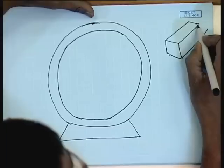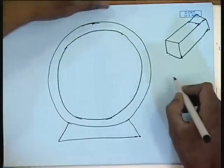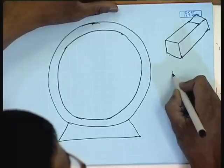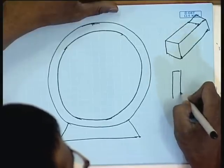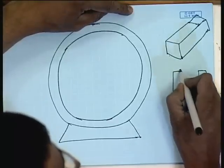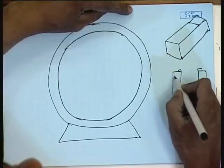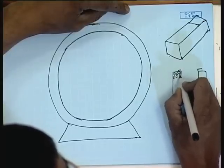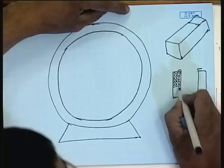This is the pole structure which carries the field winding. Field winding is made on a separate cylinder and depending on what type of winding it is — that is either shunt or series — the number of turns and the current carrying capacity of the turns are determined. I am showing a winding for shunt connection or separate excitation, which are normally made up of thin wires with a large number of turns.